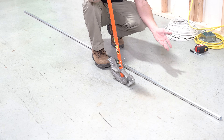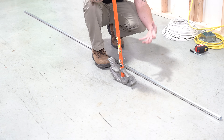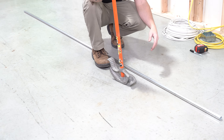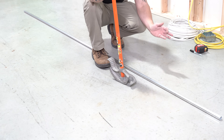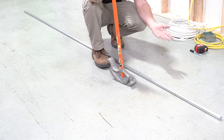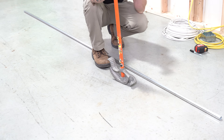Right now, since pricing is all crazy, there are actually a lot of advantages to using aluminum. It's light — I can carry a whole huge bundle of aluminum onto a job site with no effort at all. Steel is quite a bit heavier. Aluminum is a lot easier to bend, where steel is very difficult, especially once you get up into like inch-and-a-half kind of sizes. If you have aluminum, you're going to have an easier time and you're not going to be struggling as much.